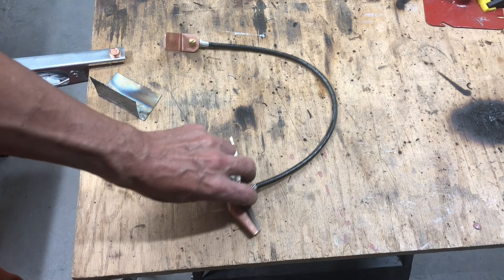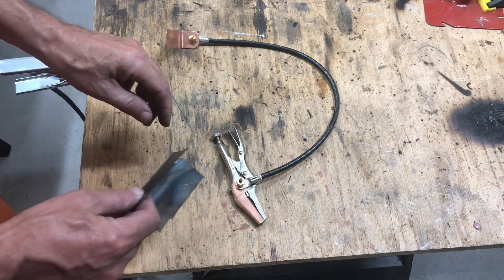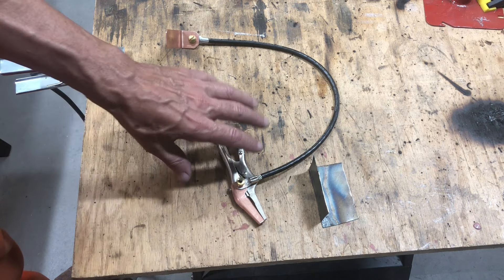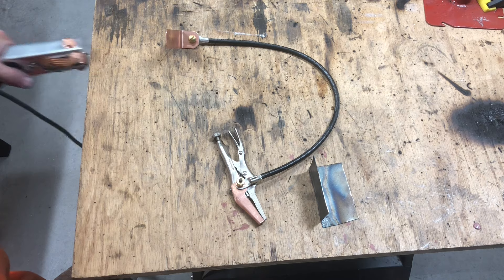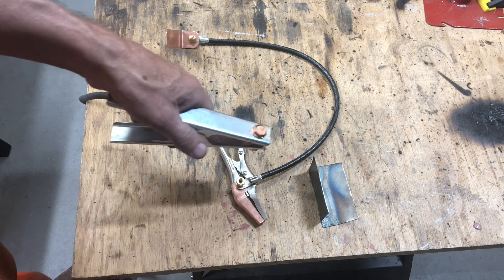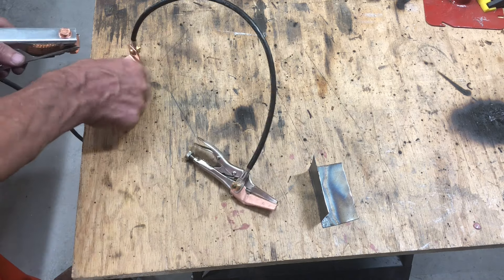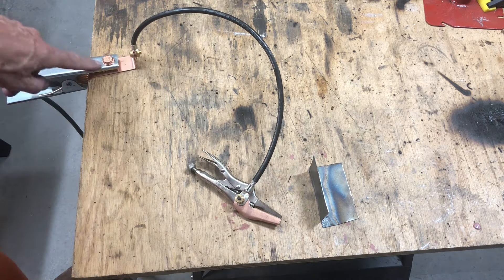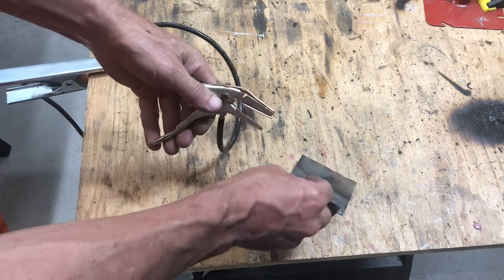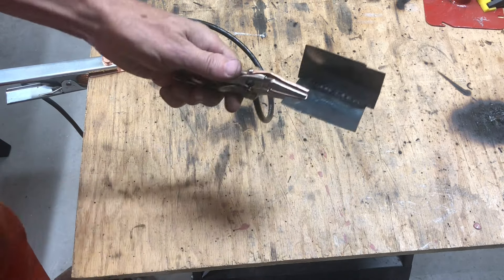First the basics of how this thing works. Let's say we have a piece of work that's either remote or it's mounted on something that's well insulated, or it's powder coated, but I can't get — or I don't want to get — my big high dollar grounding clamp near it. I either can't get there or don't want to put it right next to the gun. So I can remotely ground one end of this cable and then take my new grounding clamp and attach it to the work.